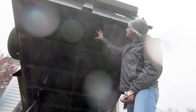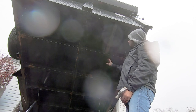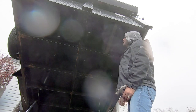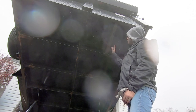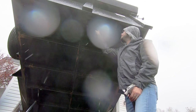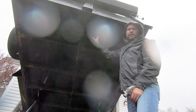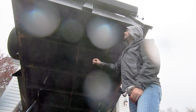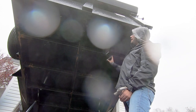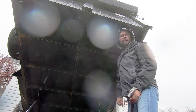The vibrator is going to sit about right here. I'm trying to support this area a little better because there's a lot of force coming from that vibrator. I'm going to put the cross members in the middle of each bay, then run two more narrow ones together. That'll be what takes the plate for the vibrator assembly — welded on there to make this area more rigid since it's going to be taking on all that force.